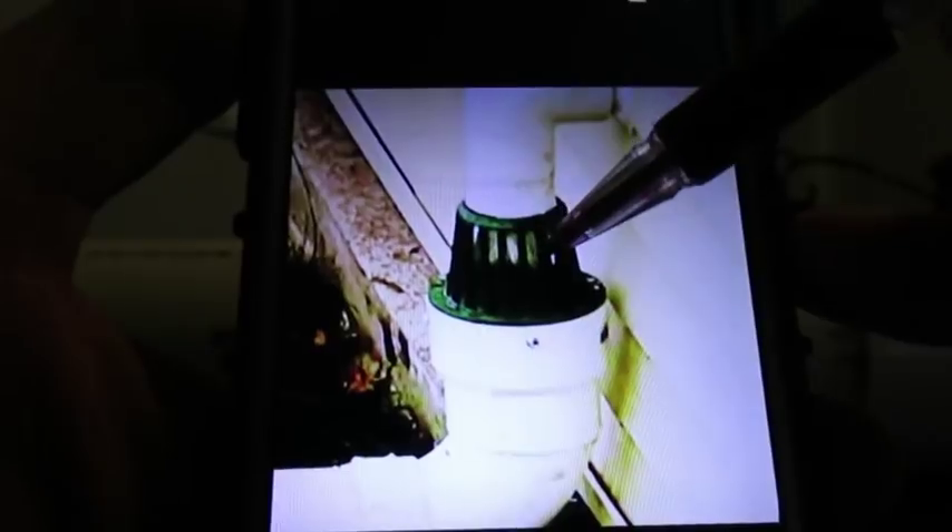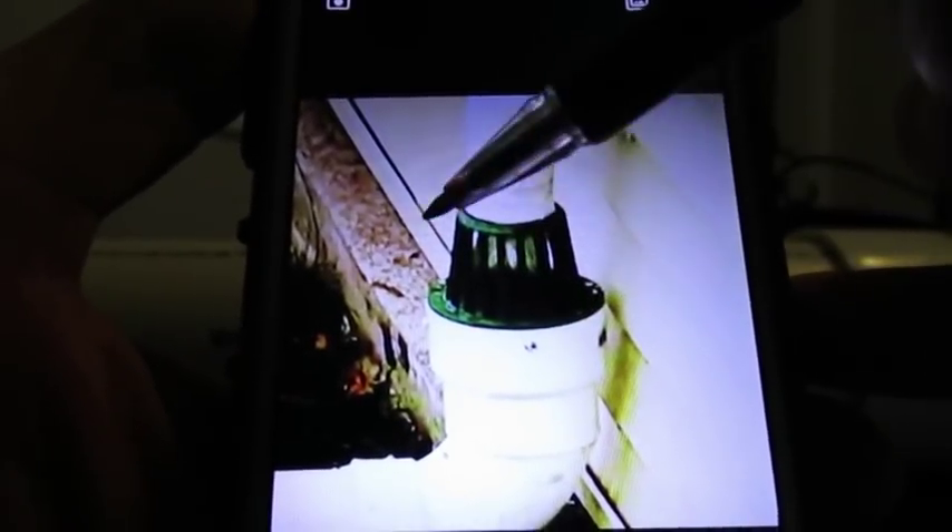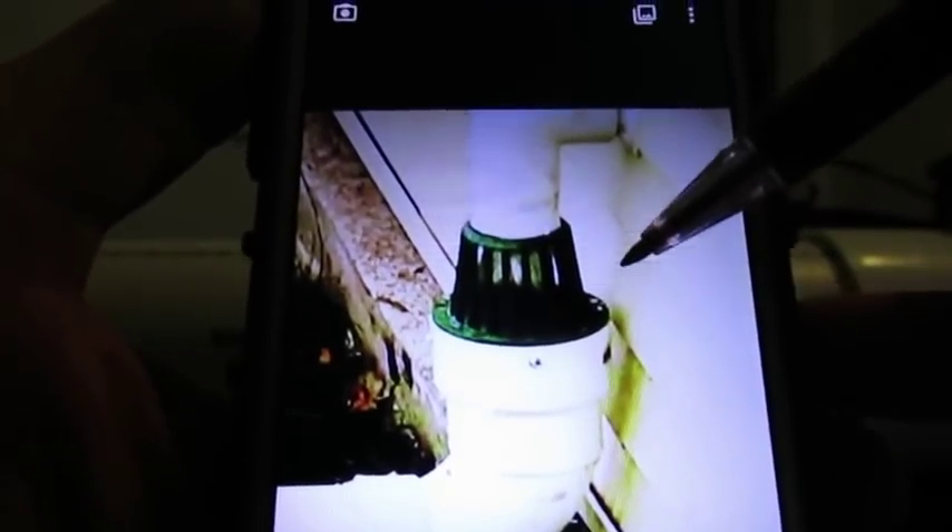Here is another freeze relief device. The water comes out here, down — you've got your air gap, it goes down through the four-inch PVC, good. And if it ever froze, it can come out of these openings. The only problem is this water — you can tell where it's likely been hitting the side of the house. To really improve this device, you'd want to have the back of this blocked so water could only go to the sides, but not hit the house. You don't want the water to hit the house.